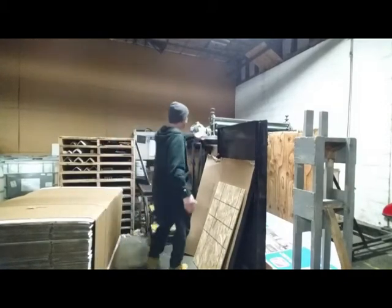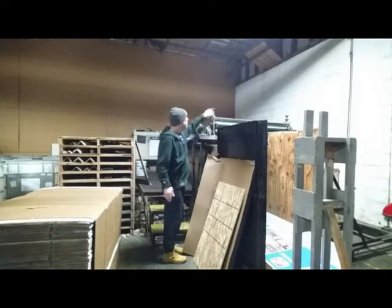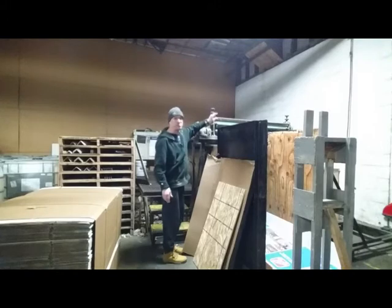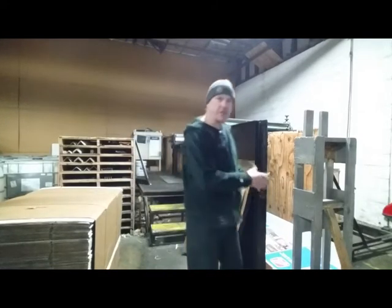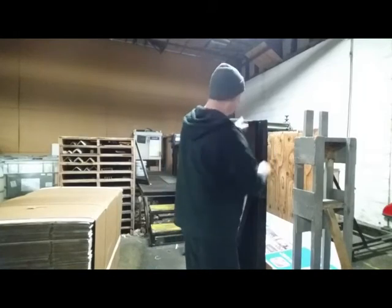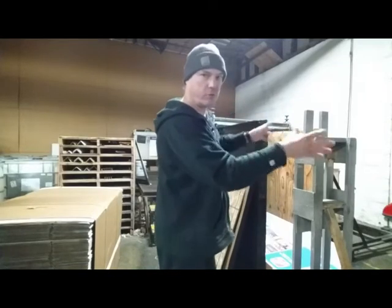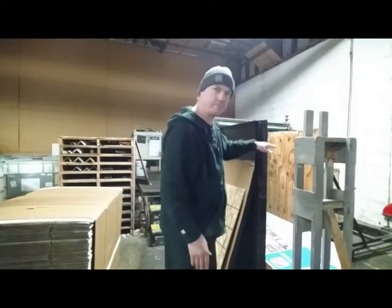And then this is called a Rotary Press. This is what squeezes the bubbles out. You can adjust it to different thicknesses of boxes, but for the most part, it's right where it should be. And for the different size boxes, you would loosen the bolts on this thing and slide it out or slide it in. The same thing with the top. You got 2 bolts. You slide it out, slide it in for the different size box. You can see they stack up.